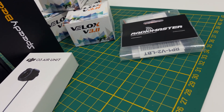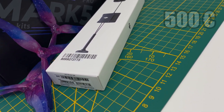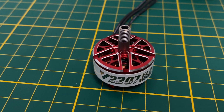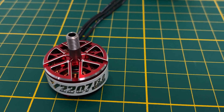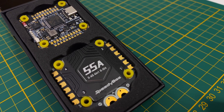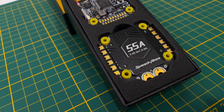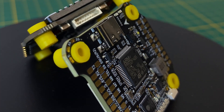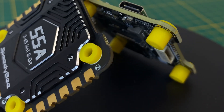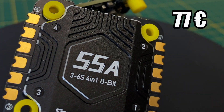Let's start with an overview of all the parts we will use in this build. The cost of this build is around 500 euro. These are the T-Motor Velox V3 motors with 2050 KV — they cost around 15 euro each. This is the Speedy BF405 V4 flight controller paired with a 55 amp ESC. It offers enough power for the motors, and I chose it for its excellent price to performance ratio. You can get the flight stack for around 77 euros.